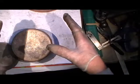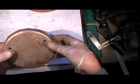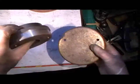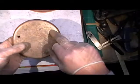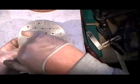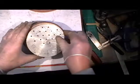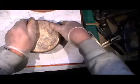Well, I've now cut them into the appropriate dimension circle. I think it was 6-inch, to make these flanges. And I'm not going to go into great detail with these because you've already seen me do other flanges and it's just repeating. But here's my former for this single flange, and I've drilled two locating holes in the flange before I started to bend it. And all I've done is pick two of the positions for two of the tubes, the fire tubes that come through, the boiler tubes. So I've picked two of them up, drilled them into copper so that they locate nicely onto my flanging block.